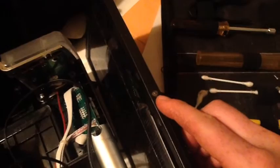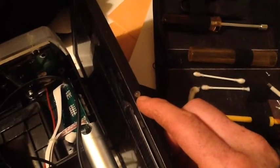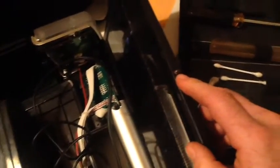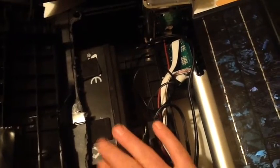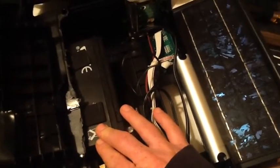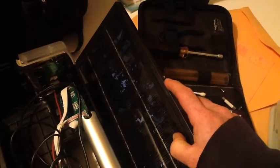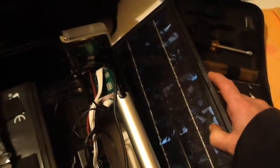After wiring it directly, I noticed a little flashing LED that shows when it's taking a charge — when the sun's on it this flashes blue. What was happening is when the sun wasn't pushing power from the solar panel to the battery, the battery had a higher voltage so power would start flowing the other way, and at night I'd see the blue light flashing.